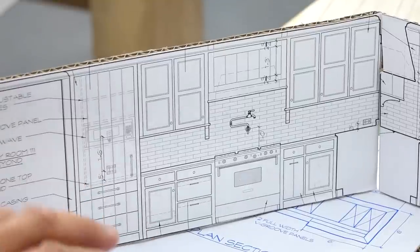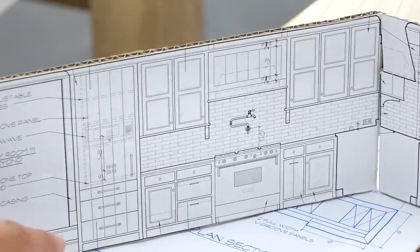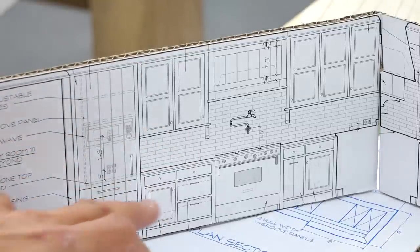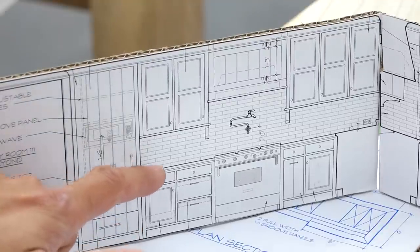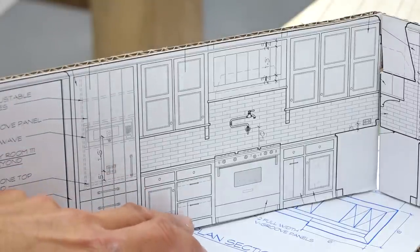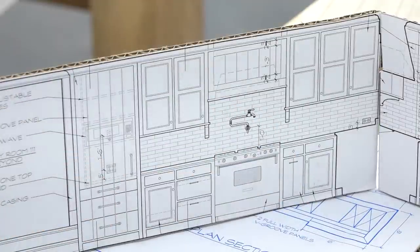So, opening things up a bit here to look at the stock we're gonna need. There are basically three pieces of stock we need. We need 2-inch strips. That is gonna be all of the styles, the outer sides of all the cabinets. We need the little piece that goes under the countertop above the top drawer or door, whatever's on top. That is 1¾ inches. And then all of the little pieces in between everything else, they're all 1 inch. So we need those three pieces of stock.